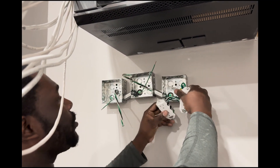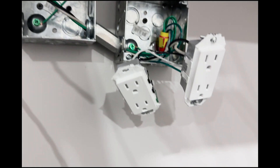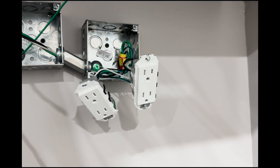Whenever you're doing a surface mount outlet it depends on the situation. In my case, as you can see, the ground tail is going to the box, I've created my tails, and everything is going to an outlet. That right there meets code, so we're good to go.